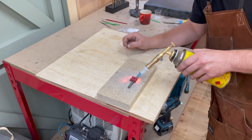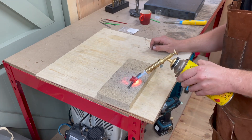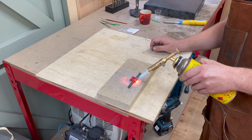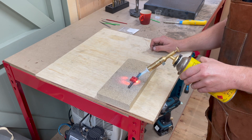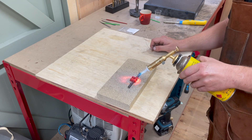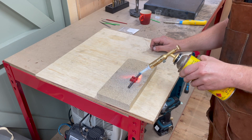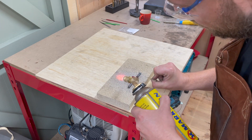But the solder generally just isn't flowing at all. I can't work it out because I feel like I applied enough flux and it's hot enough, but the solder is just blobbing onto the work. I'm trying to melt the solder that's been applied and blobbed, and it's just not going anywhere. I don't know if that's because the camping gas isn't hot enough or because there's some other problem.